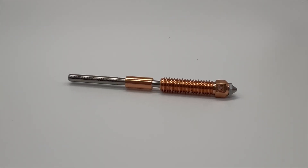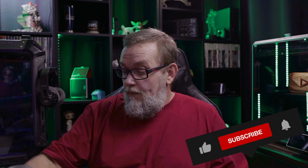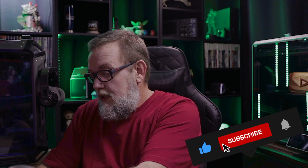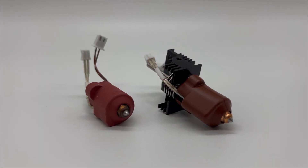I went to the store and confirmed that Creality is sending the K1 Max with the new unicorn nozzle. So instead of receiving your K1 Max with the full hotend replacement kit, you will receive this extra nozzle — a 0.4mm nozzle to replace on your K1 Max. The difference between these two hotends: this is the classic original, and this is the new hotend.